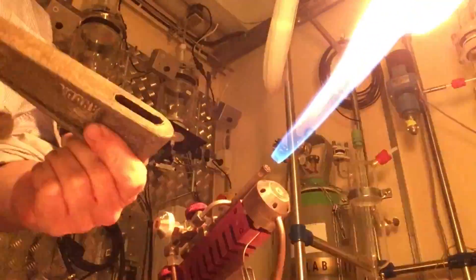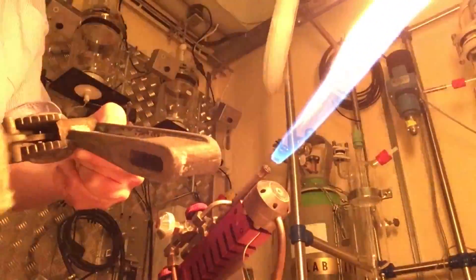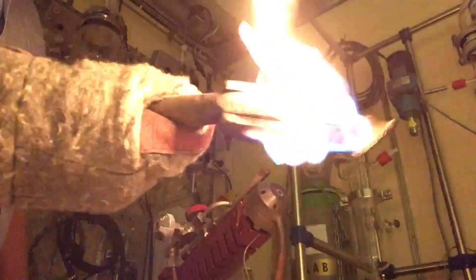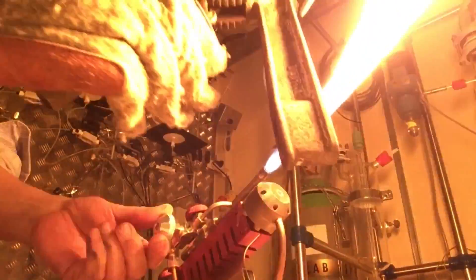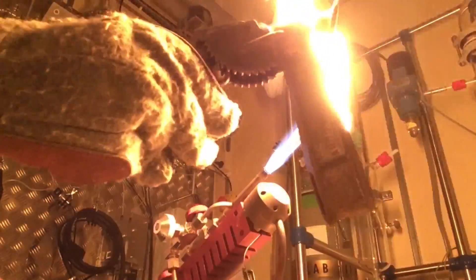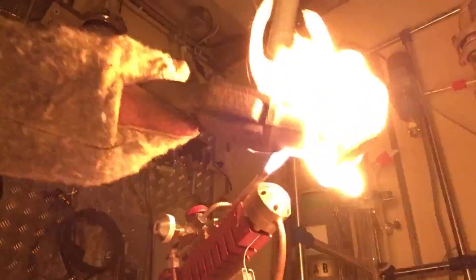The last thing I'm doing today is cleaning off the paint. Since I don't use brushes or mechanical tools for this, I'm going to burn away the paint before I electroplate this — making it into a golden vise. This is a very convenient, non-destructive way to strip paint if there are no plastic or wooden components. Hit subscribe to see the entire electroplating of this device in a new video in a couple of weeks. Thanks for listening, guys!